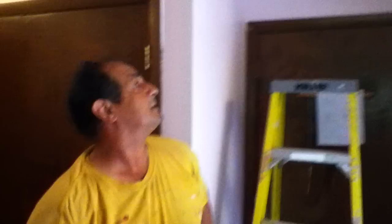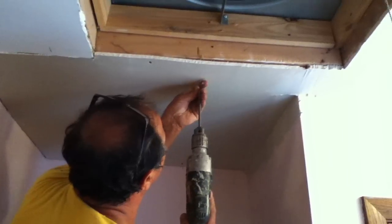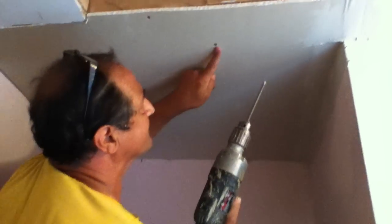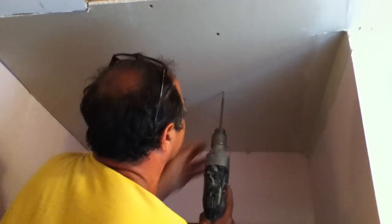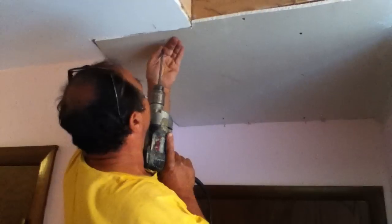That's just showed you how it's done. I'm back to finishing the job — I simply have to finish screwing up the drywall before I continue this project. There's a pencil mark here so I know exactly where to go. You don't want to over-sink your screw, but you want it below surface, or else when you hit it with a trowel it'll cause problems. A lot of people actually pencil that line, but I've done this a few hundred times before and I know my way around it.